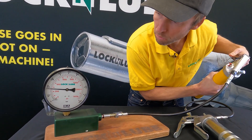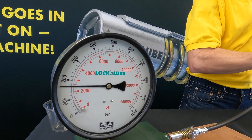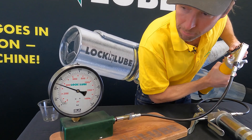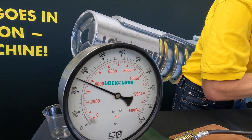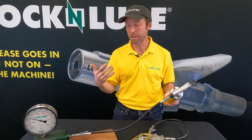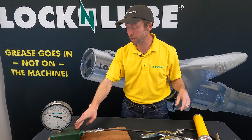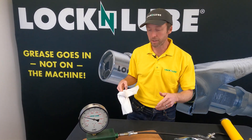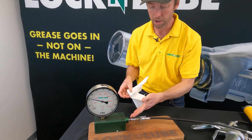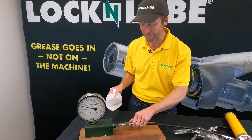The red numbers here are just under 3,000 PSI — let me try to do as much as I can. I'm hammering on this thing and I'm barely getting it up to 4,000 PSI. The gun can handle 8,000, the hose assembly can handle 10,000, but that doesn't mean I personally can get it to deliver 8,000 PSI. Because this is a dead-end system, the back pressure of grease in this block is gonna come out when we disconnect the coupler. That is not the grease coupler leaking.